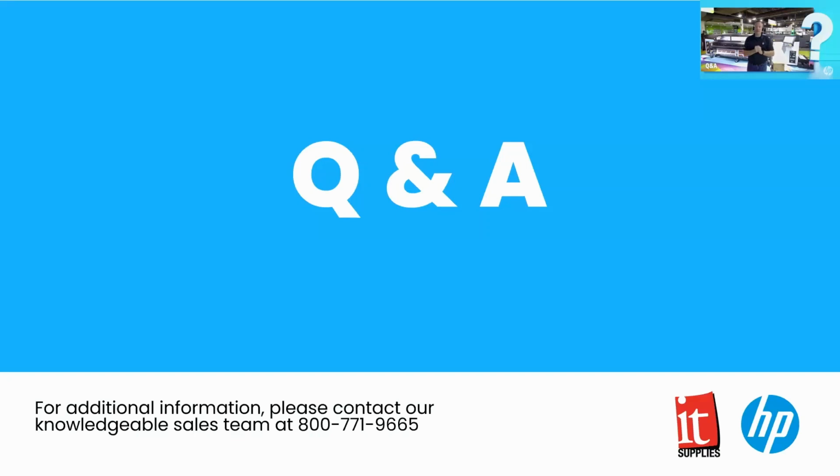That's why HP also sells a dye sub printer for that application. Also for anything that you would want to launder. Okay, so if you want to print a trade show booth, if it's a one up and done and it comes back down and goes in the trash, then no problem. But if it's going to be put up and then somebody steps on it while they're putting it back into the trade show case and then they need to launder it, that's a problem. It's ink on top of fabric instead of ink in the fabric. And so you can rub it and abrade it, scratch it, and over time you'll take ink off.